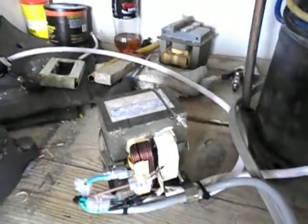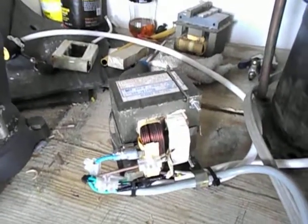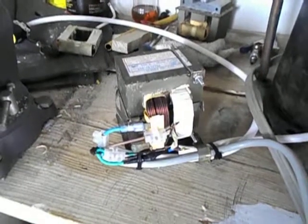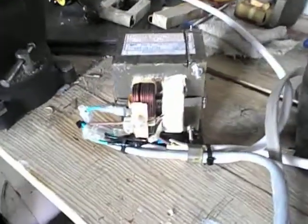The way I did it, I took two microwave transformers, split both of them open, and used the primary of one of them and added that instead of the high voltage to the transformer that I was going to use.